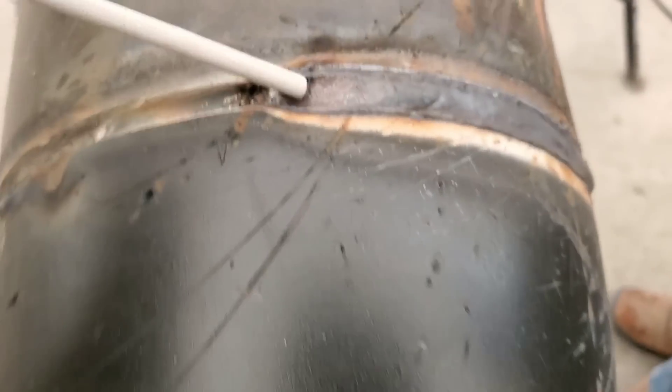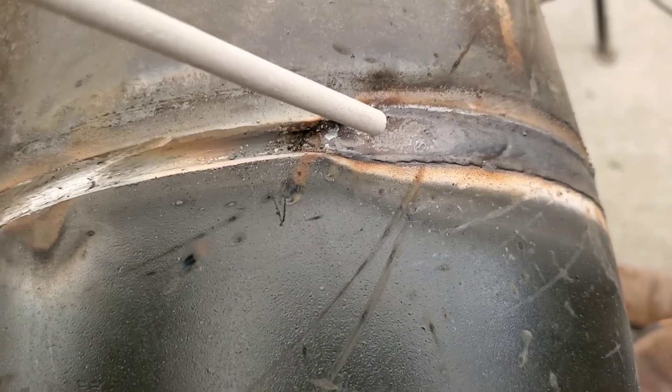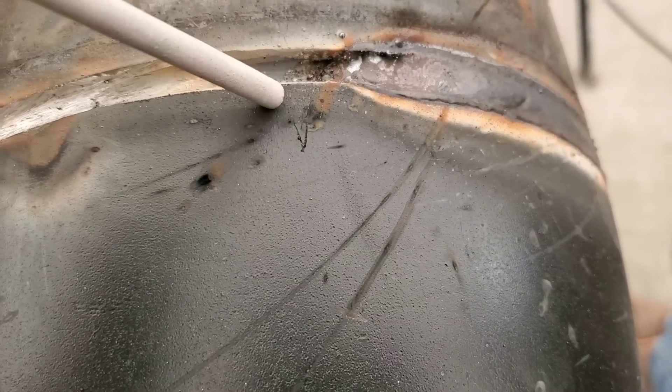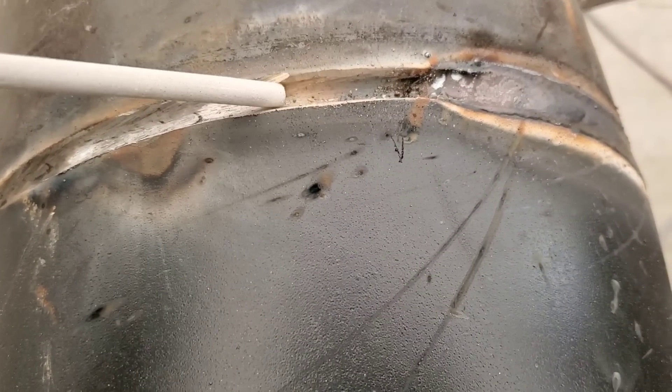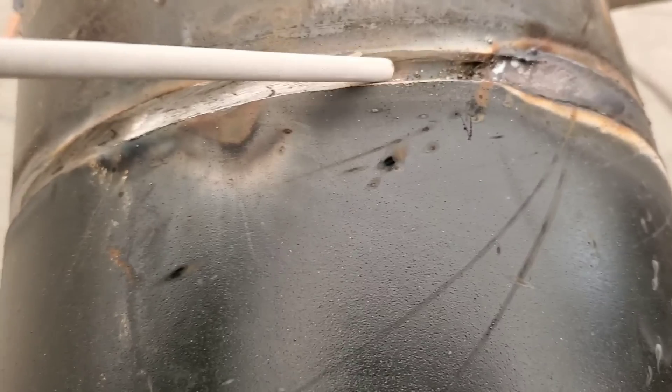When I go to strike up this arc, a lot of people ask me about the striking of the arc. What I like to do is strike it down this way — it lights up about right here, then I drag it back up and start carrying it. Because everything you leave on your strike path, you're gonna burn back out when you come this way with all that heat. You're gonna burn out whatever you dropped off to strike it. So if you broke the flux right here, don't worry about it — keep dragging it, get it lit, bring it all the way back up, lay it down, and start spilling it. Then you're gonna be able to burn out all that trash you laid down.